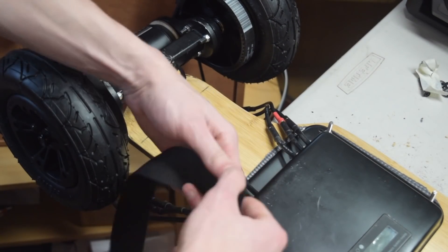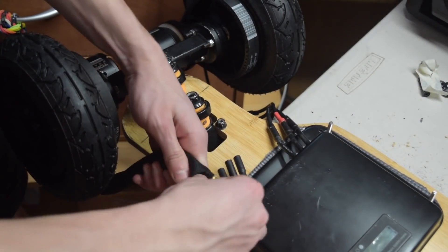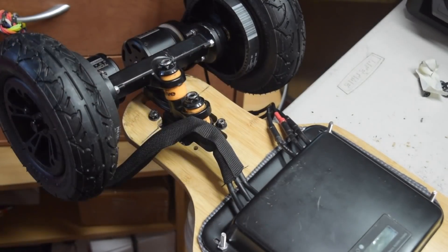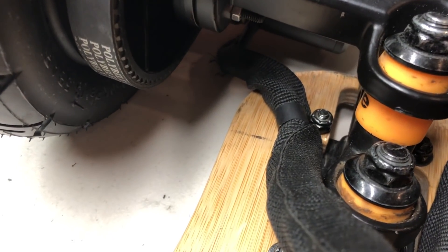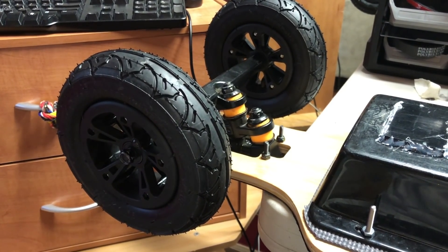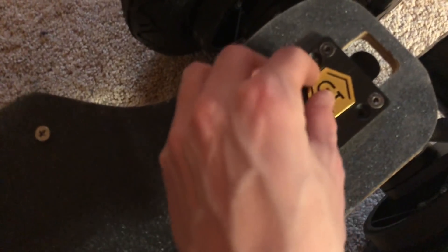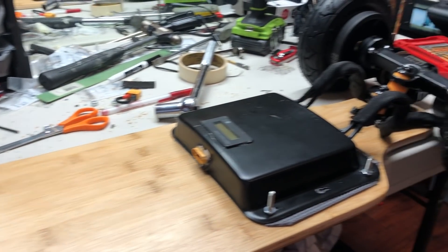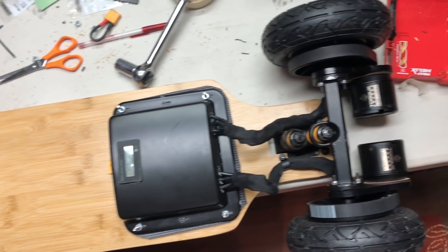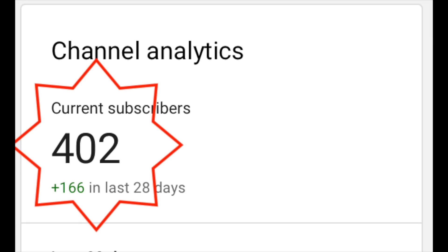For a finishing touch, we added heat-shrinkable braided cable sleeving around the phase wires of the motors so they wouldn't get damaged and would stay together neatly. We also used wire ties that come with the Evolve trucks to hold the phase wires down — they wrap around the cable and go through the deck bolt, securing the phase wire to the truck. We then mounted the front truck and put the tires on, and added the gold GT badge on top. Once this was done, the board was complete. Thanks so much for watching — if you made it this far, please consider liking the video and subscribing. We finally made it to 400 subscribers and we're really trying to grow the channel!